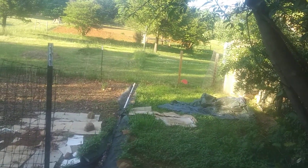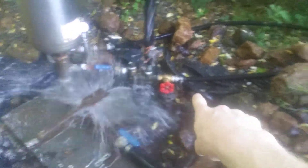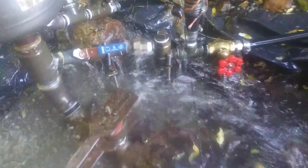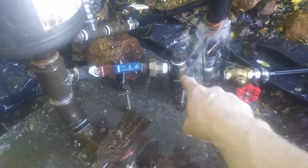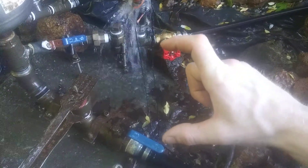So this is the ram, and I've got my drive pipe — it's a steel drive pipe, nice and rock solid. You can see it goes a straight shot to the standpipe. This is the double-acting ram pump. This side right here with the red handle — this is the spring water, the pure spring water coming into the pump. There's the standpipe for the spring water. You can see this little check valve that I made — I'll go ahead and stop it for a few minutes.